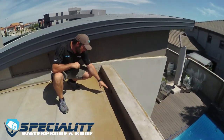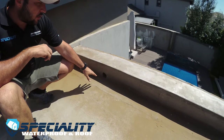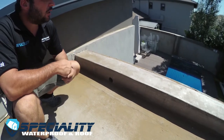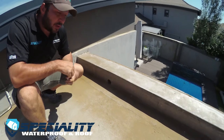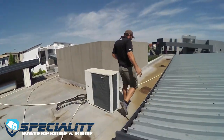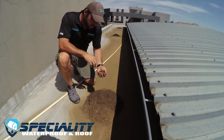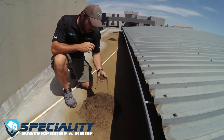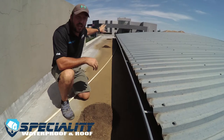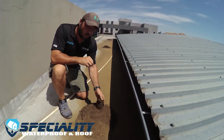These drainage holes are 75-millimetre PVC holes and they waterproof quite nicely, but they can be a problem due to dust and debris collecting on these roofs — and leaves as well if there are many in your vicinity. We've started cleaning all the debris from this roof; there's a lot of bird faeces, dust, and debris collecting, clogging up the drainage holes. There's also a lot of construction going on in this estate, and drainage holes need to be big enough to handle all this dust and debris.